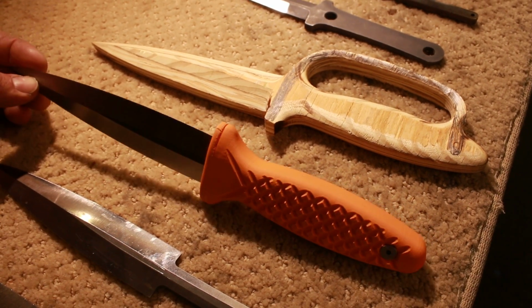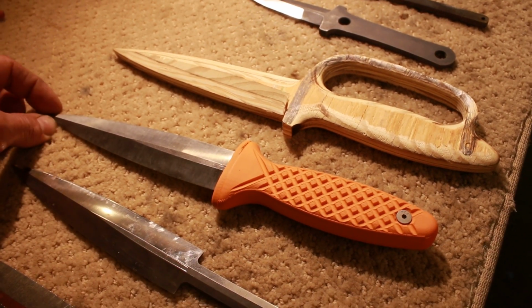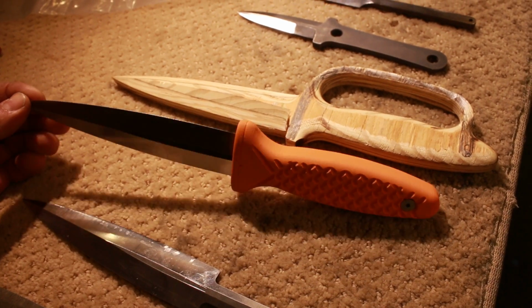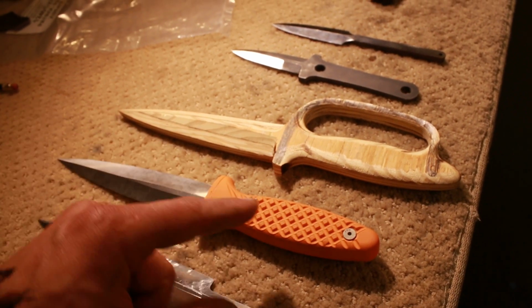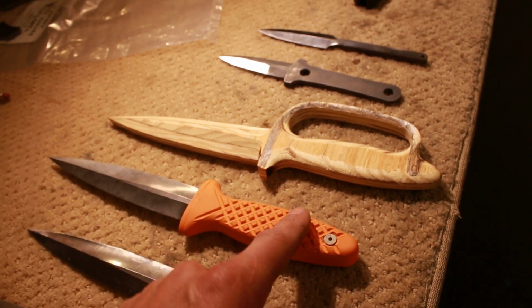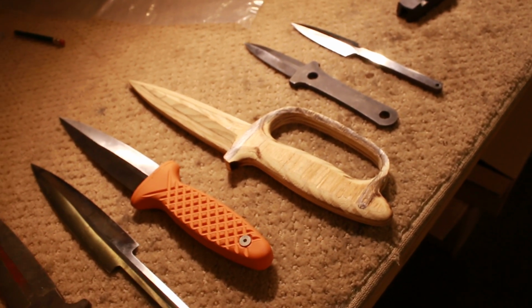this is a PLA plastic, and then what I plan on doing is having a guard made with a water jet cutter out of stainless steel or maybe brass, and then either printing or making a handle out of micarta, slipping it over, gluing it together, and then using one rivet, either a hollow rivet or a barrel nut with some screws, to put the handle on.